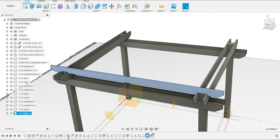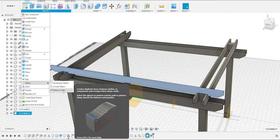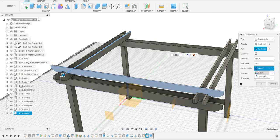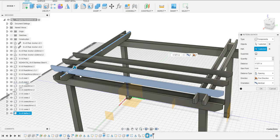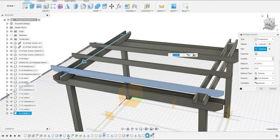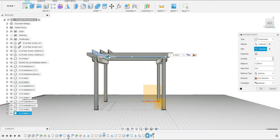Now, I've seen some people not even put these on and just do the top 2x2 slat that I'm about to do without these particular joists on top, which to me doesn't look right, but some people do it. So pergolas are made in many different ways. Some people make them to where you can have like a trellis top to where you have vines growing all over them and you really can't see the structure anyway. So in that case, it may not make sense to use so much lumber. But if this is just out in the open by someone's pool or something, I think you would really want to go the way I'm going here on this particular design, in my opinion. But it is a lot of wood.